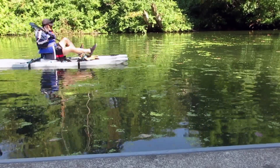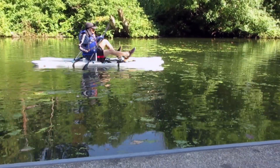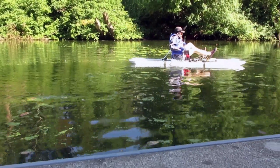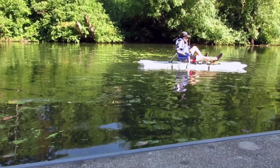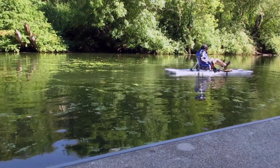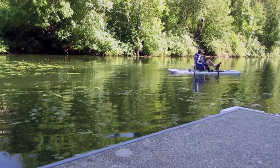There are many things I can do to improve the efficiency of this design. I should add a few more stoppers to prevent the fins from bending backward when pedaling. The pedaling arms can be replaced with thinner and stronger aluminum extrusion U-shaped channel. I can also replace the fins with thinner material, add bicycle pedals for more comfort, and investigate how to design a more reliable and stable pivot for the arms. If you have other suggestions, please let me know.